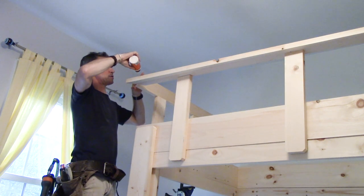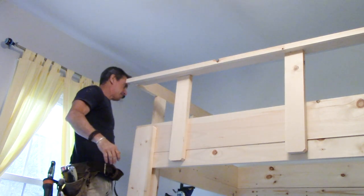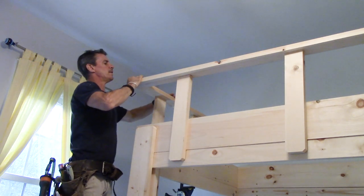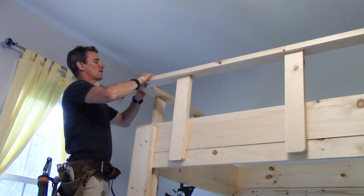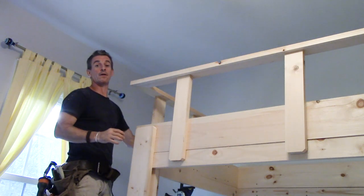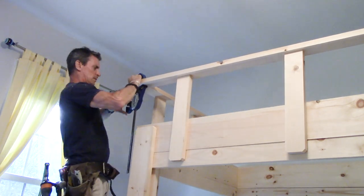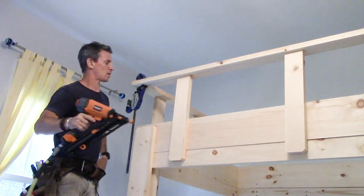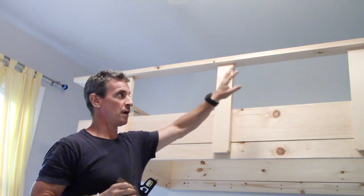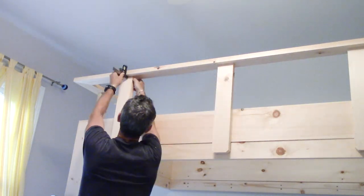There's really only one place to connect this — unless I use biscuits or domino or something — and it's out here. I'll put this piece like this, and this like this. For a little added — oh, that's nice right there. That's not going to close up any tighter or be any tighter a miter. I'll take the finish nailer — I suppose I could use a brad nailer — and give her a couple of pops. My weapon of choice for positioning the now single-unit three-piece top cap is my combination square.